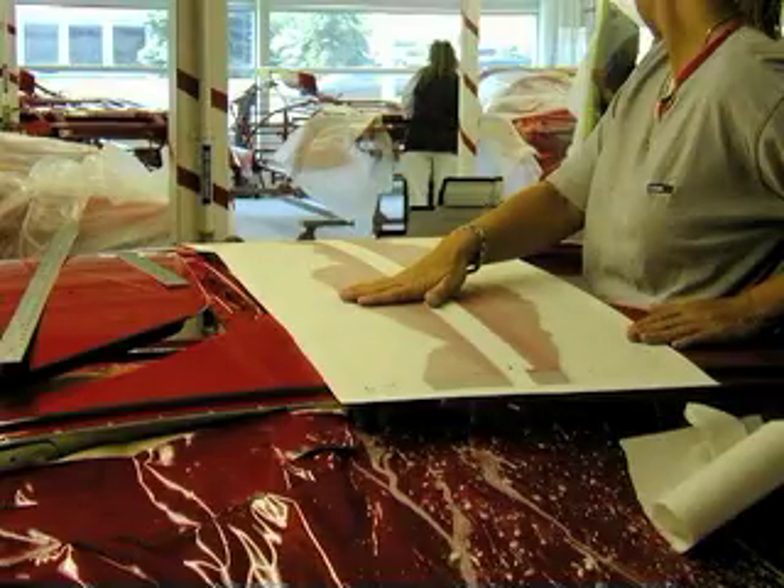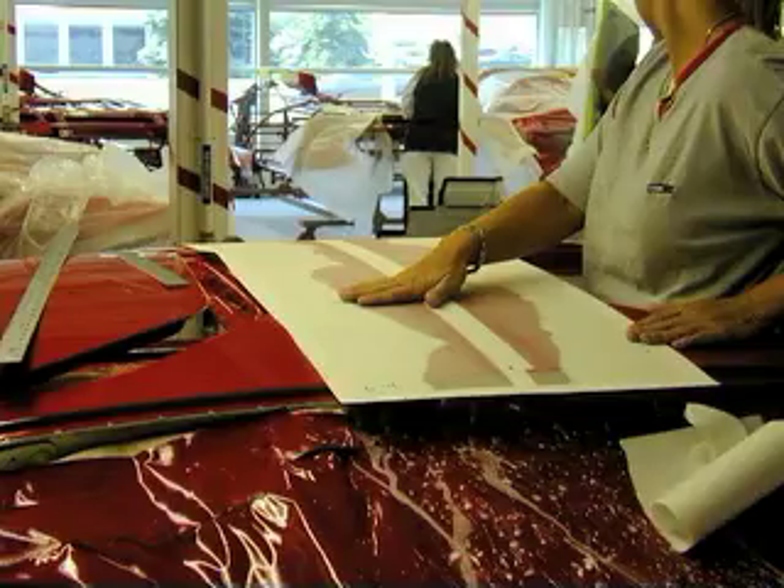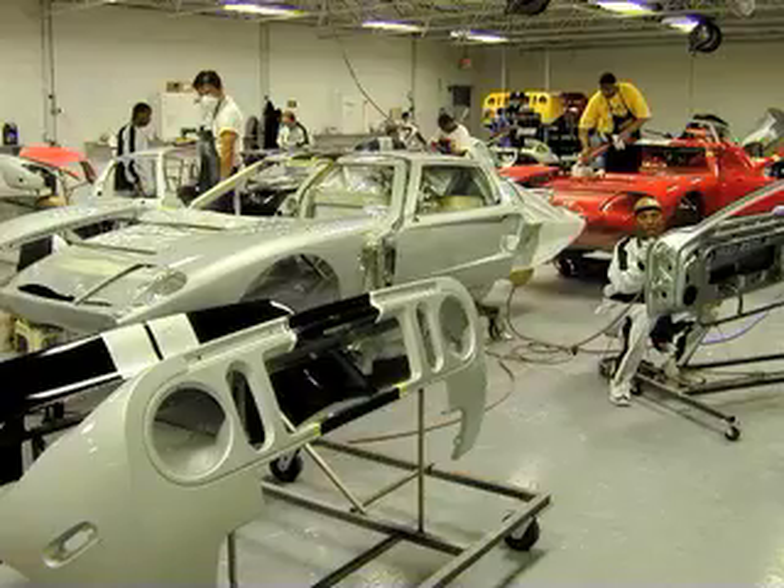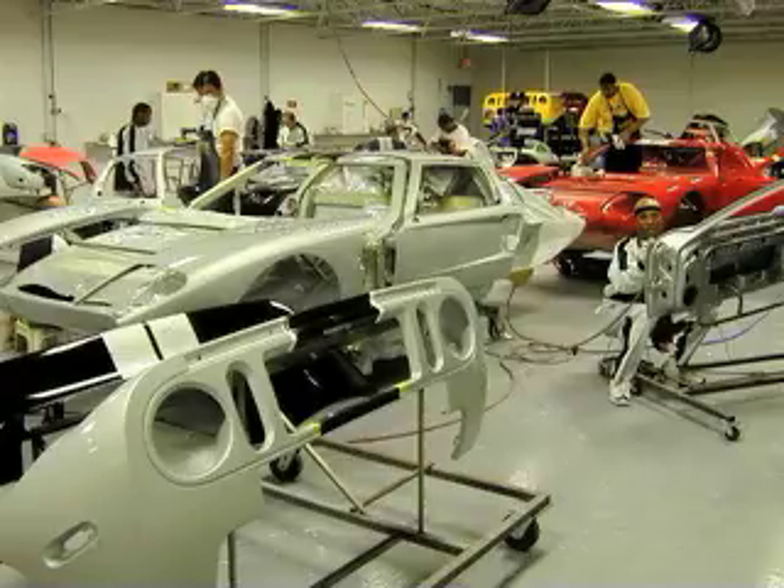Cars getting the optional stripe kit are masked for painting. This is a lower bake process that occurs when the non-aluminum body panels are painted, such as the hood and the front and rear fascias. The low bake paint booths are used for all of these items with the temperature set at 180 degrees. The polish area is the last stage in the paint process. All panels are hand polished and any minor imperfections that don't require repainting are addressed here, such as a small speck of dirt in the paint that can be rubbed out. Final paint inspection also occurs here.